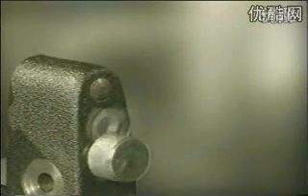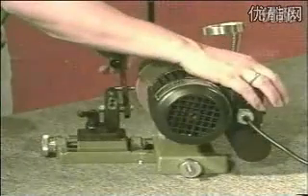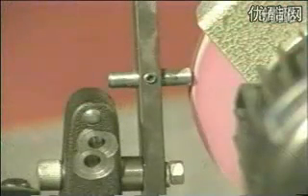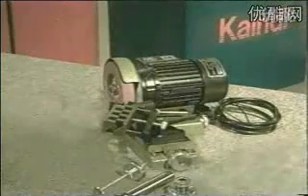Fix the clamp in the lower or upper hole. To get optimal grinding results, the grinding wheel should be dressed from time to time with a diamond grinding wheel dresser. Various grinding wheels, a magnifying glass and a wheel dresser are available as accessories.